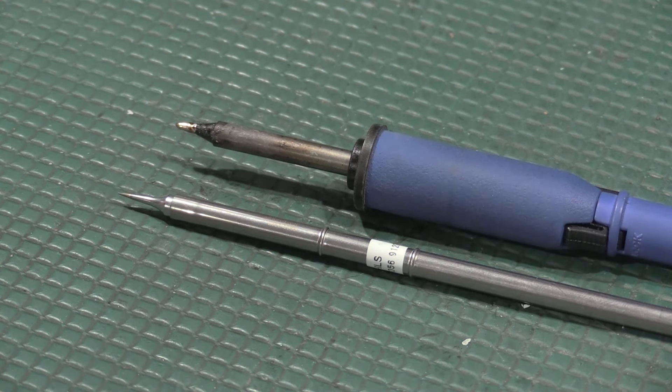There can be a little bit of a thermal lag where you suck a whole lot of heat out of the tip and it takes the iron a second to wake up and start applying power to put more heat into the iron tip where it actually needs it. Depending on what you're soldering, that may or may not be a problem. With some very high thermal mass PCBs — ceramic strips, for instance — it can soak a lot of heat out of the iron before it wakes up and starts applying power again.